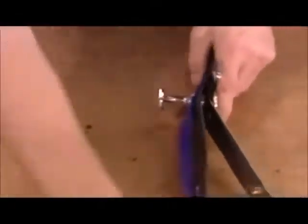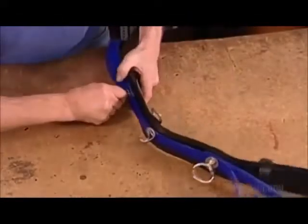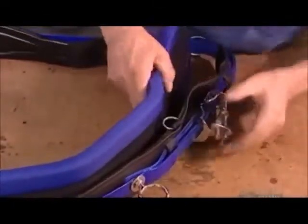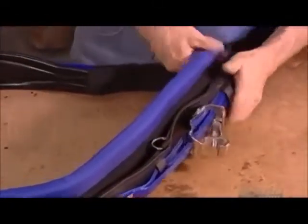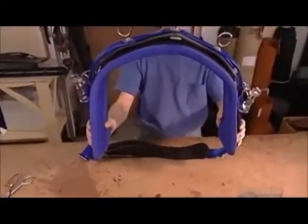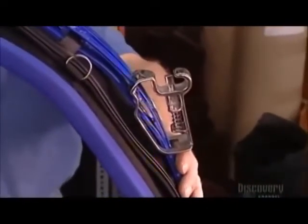Next, they assemble what's called the tree, the rigid stainless steel structure that goes on the horse's back. The outer part is made of plastic. They stitch Velcro to the underside. To that, they attach a nylon-covered foam padding that protects the horse's back from irritation. The finished harness with all its hooks and terrets weighs 4.5 kilograms. It's taken 20 hours to make.